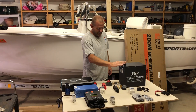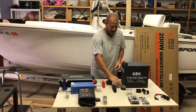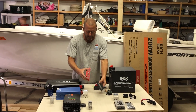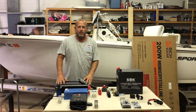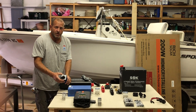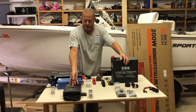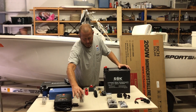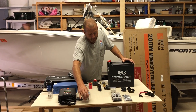On the negative side, going into the battery, we have a shunt that's going to read the state of charge for this battery. Everything is going to go to these two bus bars, and from the bus bars we divert off into the system. We have the 2000 watt pure sine wave inverter, a manual changeover switch, the Ames power converter battery charger, and the Rich Solar 40 amp MPPT solar charge controller with Bluetooth. Everything's going to have its own disconnect — from the solar panels to the solar charger, and from the solar charger to the rest of the system.